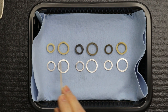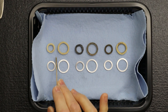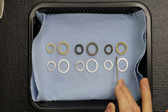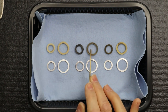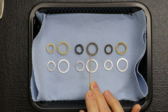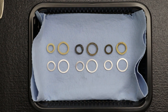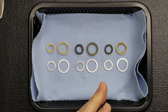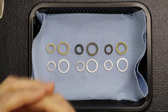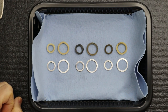But it is interesting to note that the latest grinding attachment is definitely a later year than this older grinding attachment, and they went with soft felts for both sides. But for the spindle used for the micro drill accessory, we wonder if they chose a harder grade because it's a different application. Maybe they didn't need that soft felt to hug the spindle for the drilling application, but they needed it for grinding because they really wanted that seal against the grinding dust. That's a good probable reason. I think that was a good idea you had.